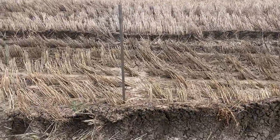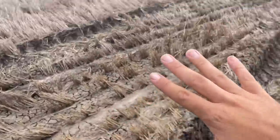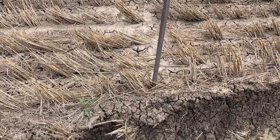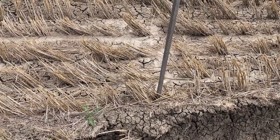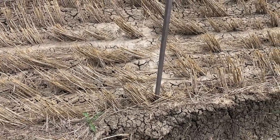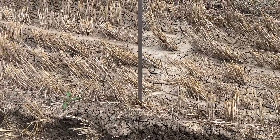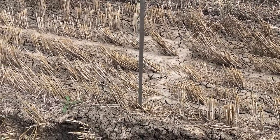Brad is tidying up a bit of contracting with the RoGator so I'm left here to do the domestic duties. You can see here this is in line where the pipe goes, and we've got a stake marked here because water was coming out of there and all this was wet, as you can see from the marks. I do have to get the shovel out - it's been a while since any of us have swung a shovel around. All three of our loaders are at the development block still so can't use them, and if I'm by myself it's pretty hard to use a loader without making the problem worse by ripping up a good two meters of pipe. I'll just start with the shovel.